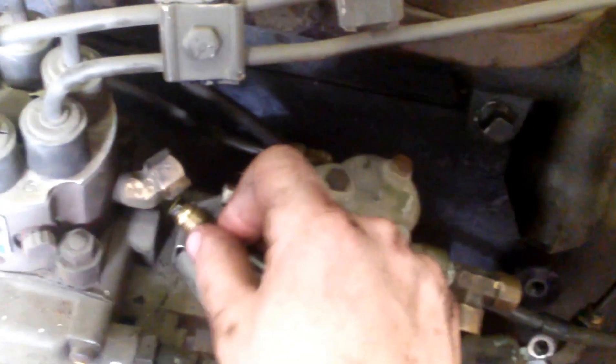When you pull these fuel lines apart, one thing you will notice: your outlet from your fuel filters is not quite long enough to comfortably mount it into the back side of the hydraulic head. If you use this line, it's going to be on enough of a bind that it's also going to rub on the fuel filters. There's a good likelihood that that will snap going down the road.